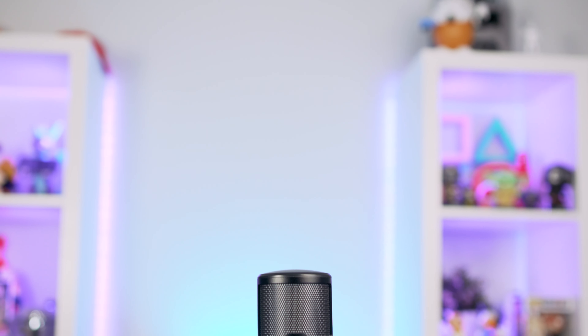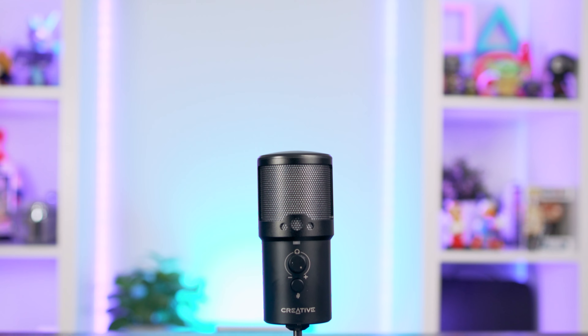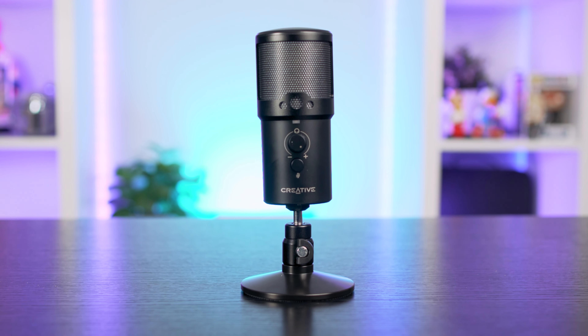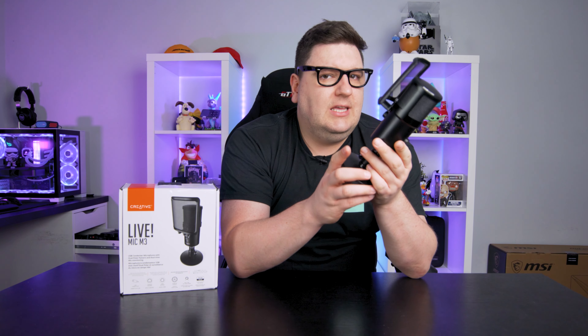The other thing you could do is physically move the microphone towards your mouth. It does come with an included pop shield to protect you from those plosives, and the proximity effect of this microphone is actually pretty good. But do remember, this is a condenser microphone. So the closer this microphone is to your mouth, the lower the gain will have to be set, just to protect you from peaking and distorting your own vocal audio.